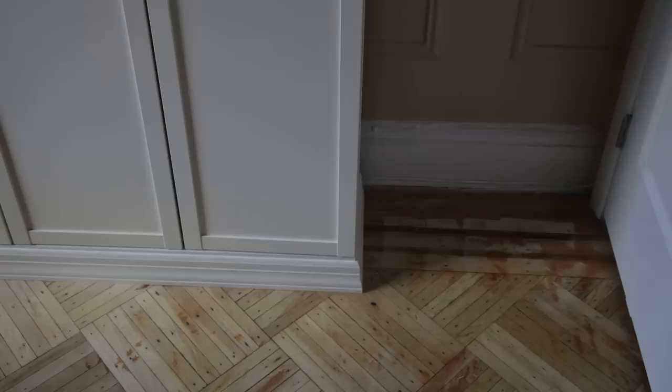I then attached the crown molding again with my nail gun, making sure it was centered on the cabinet and just below the lip to create a nice clean line. On the side seams of the crown molding, I used some liquid nails and also some caulking that you can sand to make those seams nice and perfect. I used painter's tape to hold everything together — I didn't have a lot of fancy clamps and honestly the tape did the trick. I put lattices on all the seams and all the sides to make everything look like one cohesive piece. I then attached the baseboard made from a piece of MDF, put all the doors on the cabinet, nail gunned it in, and applied the base molding on top of that.